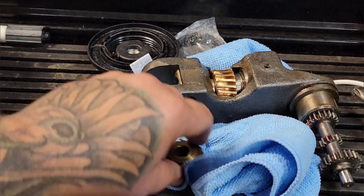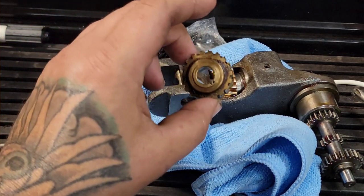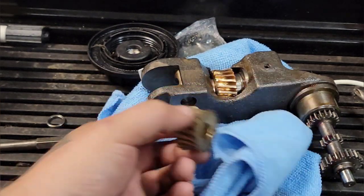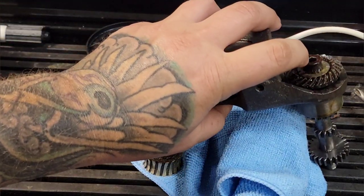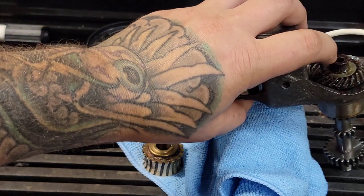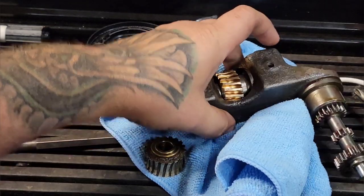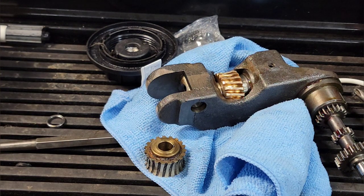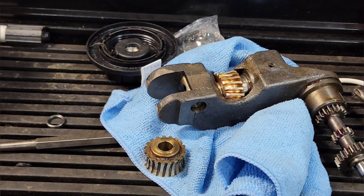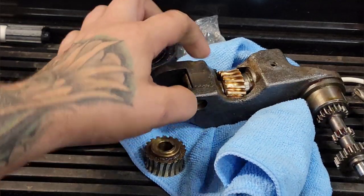Alright guys, we got our new gear - maybe in a little better shape. I thought real quick I'd take a minute here and show you guys how these come apart. It's relatively simple. Basically, pull this cap head screw out and you can pull this ring gear off. And then there's a set screw here - this whole shaft has a bushing that the set screw holds in place. You want to make note of the way that comes out because the hole is offset, at least on this imported mill. But this whole thing will come out and you can disassemble the shaft and replace that.